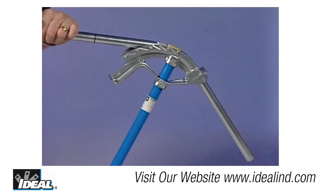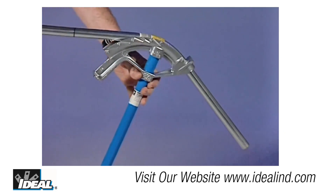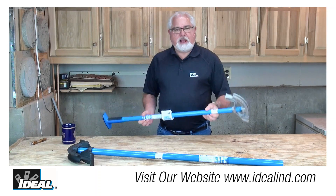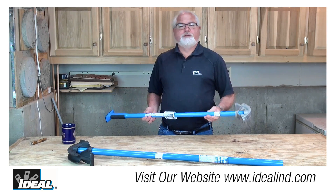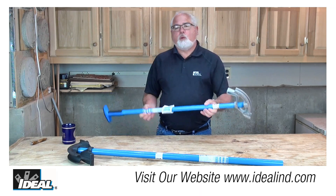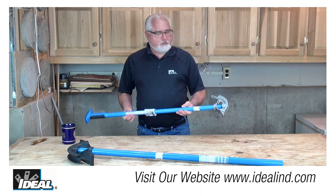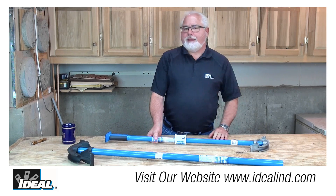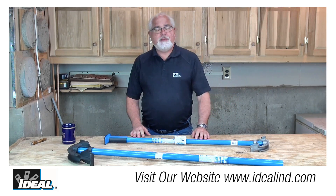Along the wall, the electrician will need to bend the conduit so it goes over the pipe and then bends back to the wall and continues along it. By using a combination of these four bends, an electrician can install the conduit system for the electrical wiring in a building. Electrical contractors don't bend the conduit and then cut it to the right length — when they get done bending, the conduit is already the correct length and shape for that installation.